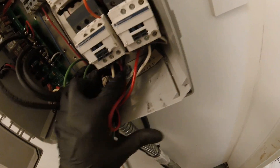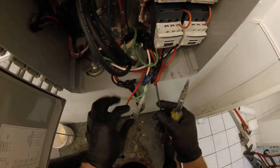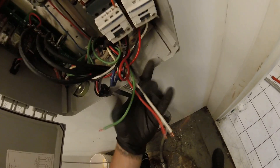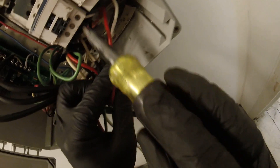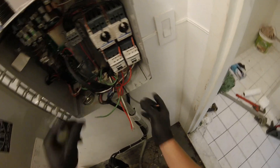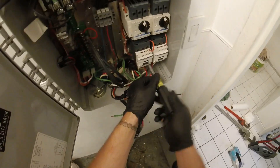This is the left contactor motor starter — white, red, black. We're going to go with the same color, hopefully we have the same phases. Then our ground — we're going to go to ground. So I'm going to start by disconnecting our pump. That's black. Just go wire for wire and I'm going to go over here.